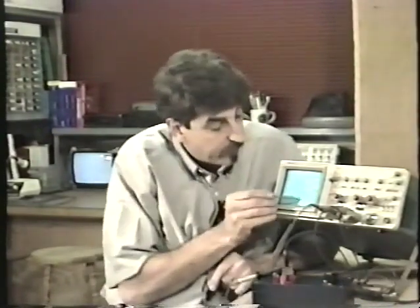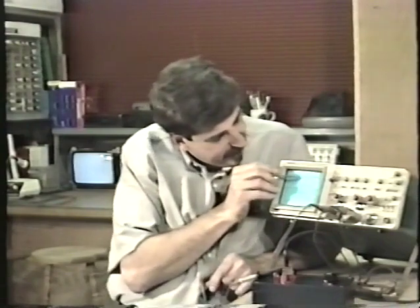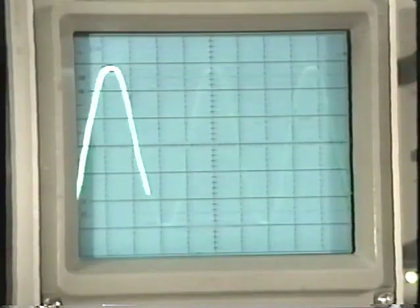Look, it's 5 volts per division. So you just go, okay, 5, 10, 15, 20, 25. It's a little less than half. It's about 27 volts, something like that. I mean, yes, you can count up. Each subdivision is 1 volt, and it is 26 and almost up another subdivision. It's almost 27 volts. In oscilloscope work, to be honest with you, that's close enough.